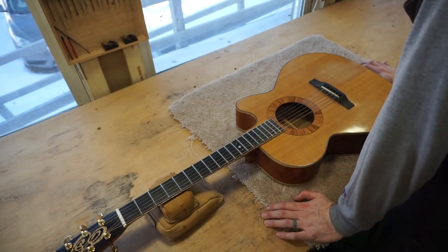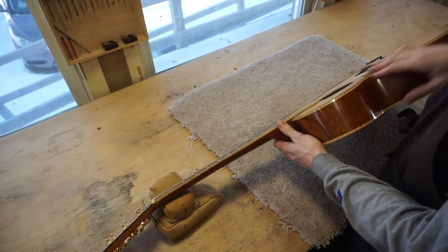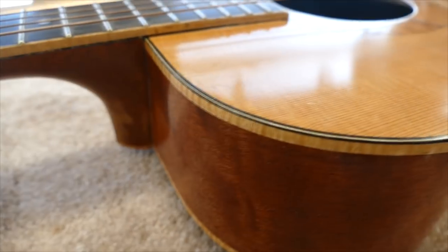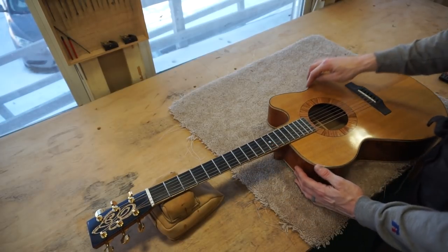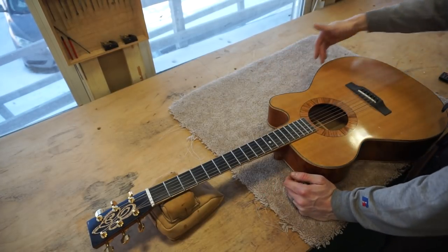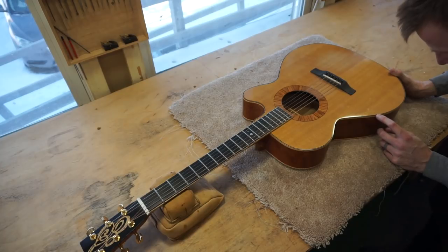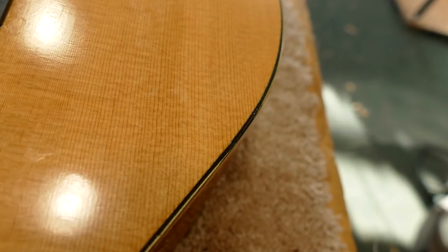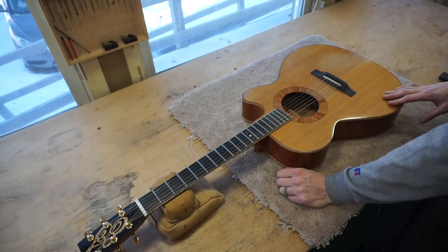I'm ashamed to say this isn't the only guitar where I made that same buffing compound mistake — though I don't do it now. The purfling on the top is not done traditionally; I routed it right over the top of the binding, so rather than having a step channel with a visible binding strip followed by the purfling, all you see is the purfling. It's done very poorly, with sanding through in certain areas. Down on the side it looks like I tried to patch a missing section of purfling using a black Sharpie — it doesn't look good. Again, all because the sides weren't meticulously flat and square.